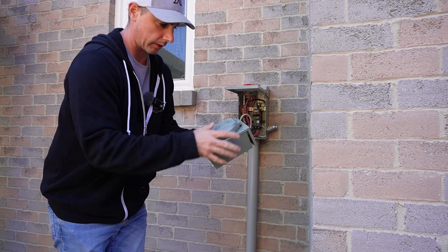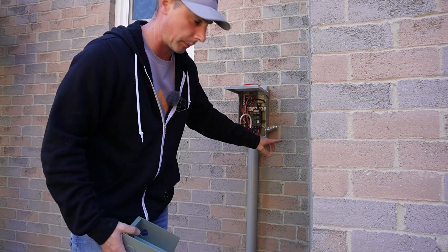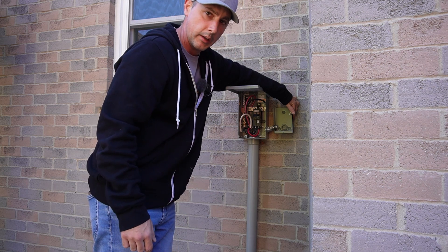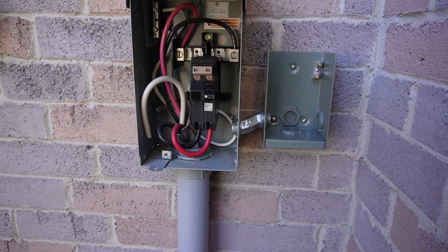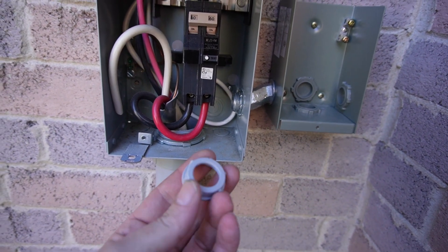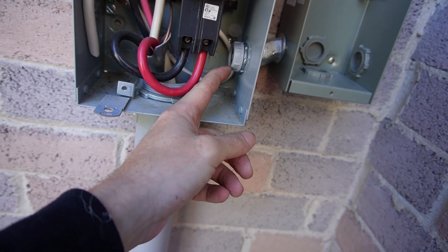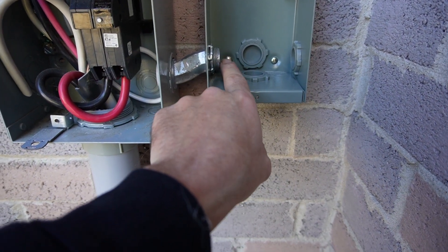I took the screw out on the bottom, removed the ground wire so I just have the box. I've got my offset up on the wall and the offset open, so when I mount this to the wall it's going to sit perfectly flat and be clear of everything. I just need to drill some holes, put some screws in the wall, and then I'm ready to start running my wire. That turned out rather nicely — except for the sticker residue, which I'll scrape off later. Another thing to do when running conduits is to use this plastic washer — it just installs right over the top of the knockout edge, and what it does is soften that edge so wires don't rub and potentially fray through. I'll install that on this side, and after I run the wire through I'll install the cap on the other side.